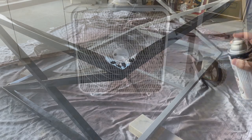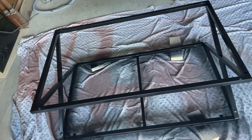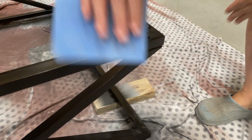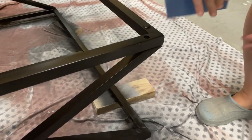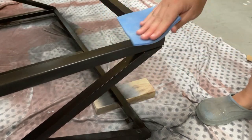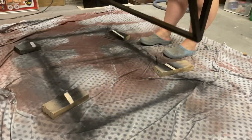It's been super hot and humid, so after I sprayed my first two coats upside down on the base, I put our box fan on just to keep the air moving out in the garage. Before I flipped it around to do the other side, I noticed there were a couple of little specks of dust that had landed in the wet spray paint. So I used some super fine sandpaper just to sand those smooth, then flipped the table the right way around and applied another two coats of my black paint.